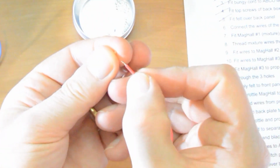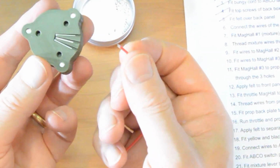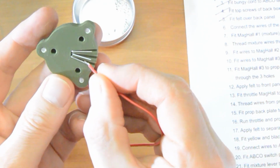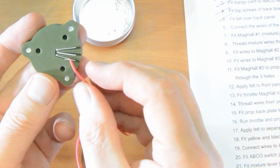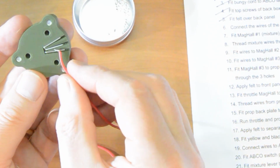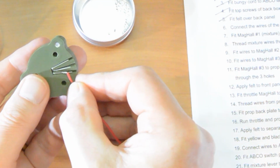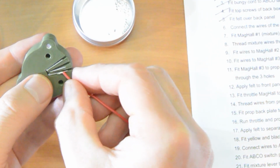Right, let's have another go. Take the wire, slide on a ferrule, RBW, red, blue, white. So red on the left, slide the ferrule over the leg. Now, if you push it, there we go, push it like that so that it goes beyond the end, because what's good to find is the point at which this, you see how this channel gets wider, gets wider from the root of the legs to the outside, and you want a point at which the ferrule just kind of presses into the channel and holds itself there.